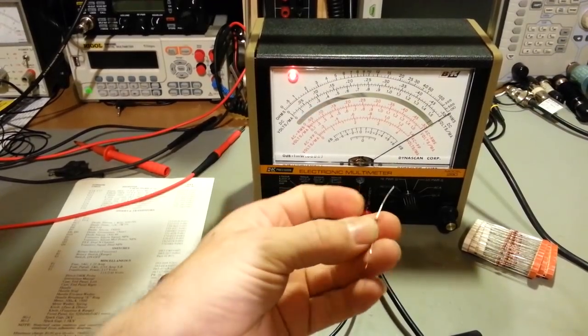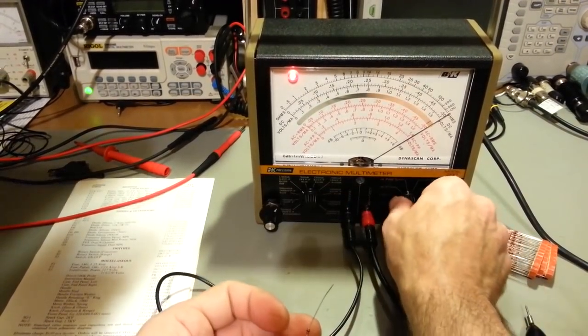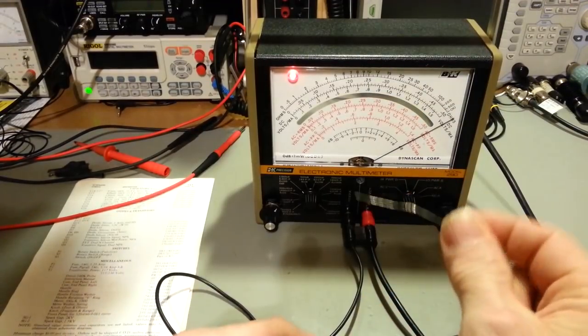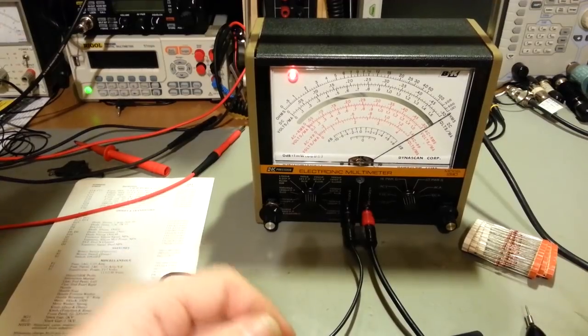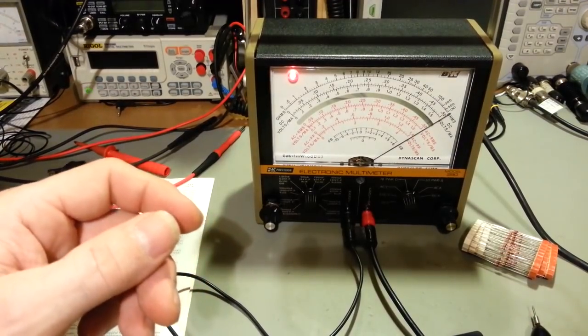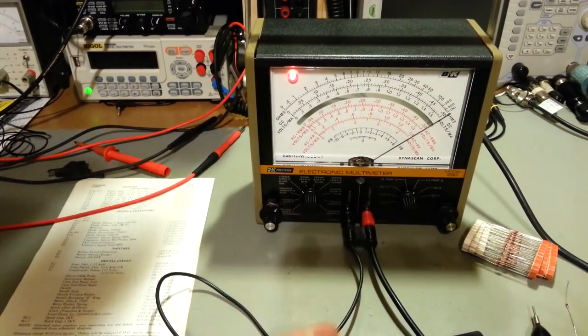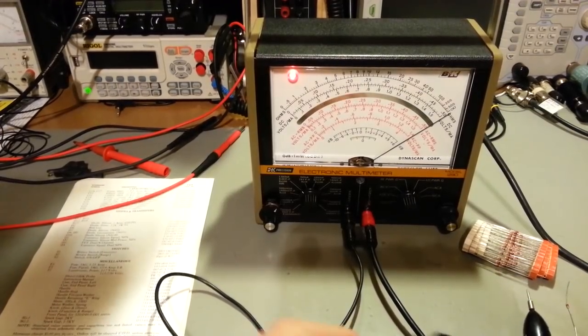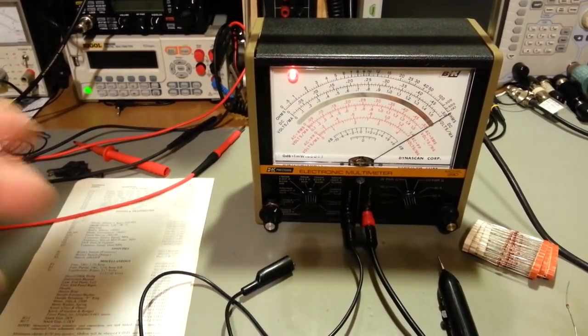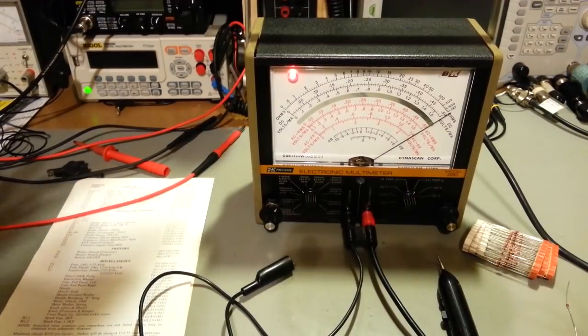So, that just shows that in the low power ohms position, there's not enough voltage to turn on a semiconductor like this. So you can take accurate resistance measurements in a circuit with no fear of turning on a transistor, an FET, even integrated circuits and the like. And actually, you can measure. Now, it might be not so much with modern microprocessors; they're so advanced.